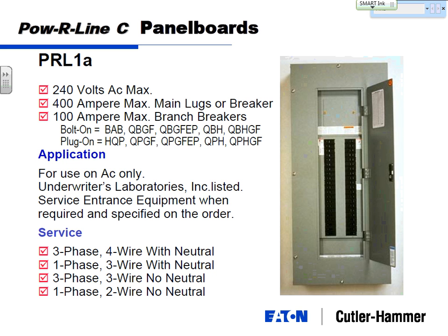And one of the differences between, why do we like bolt-on breakers versus plug-on breakers? Meaning, I say as a manufacturer, and somebody who looks out for safety, you've got a hard bolted connection, as tight as you can make that bolt, meeting the torque limits. It's that firm connection. Loose connections generate heat. Heat generation leads to failure. Load centers, being you're plugging stuff on, no matter how you construct it, you'll never get a tighter connection than a bolted connection. So load centers are used for lighter loads, you're fine. Lighter duty short circuit currents, you're fine. The heavier short circuit currents you get, or the heavier loads you get, this is the only way you can do it, with a bolted connection.